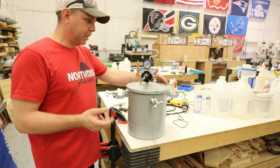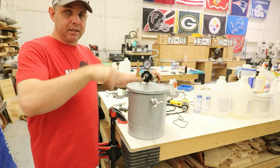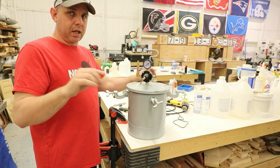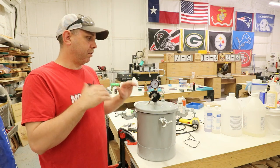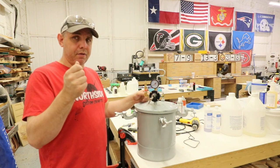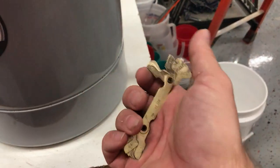The bottom of this pot is concave, and people ask why not just fill it with resin. Well, if you spilled resin on resin it would come together and be one thing. A lot of people cut a circle out of HDPE plastic and put it in there. You really need to level whatever you put in there - whether you level the pot or level the insert in the pot - because I came out with crooked blanks and learned that the hard way. Sometimes Harbor Freight makes different iterations or thread sizes of this. If you buy one and it's different, you'll have to figure out the thread sizes using thread gauges. I'll put a link to some tools like that below.